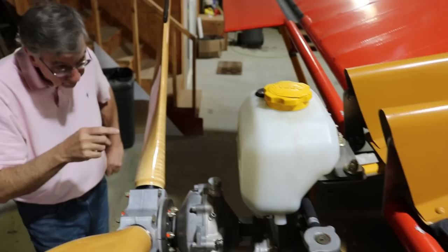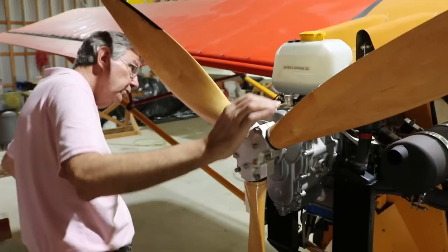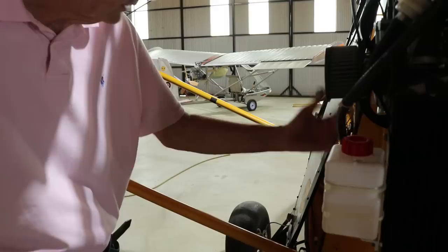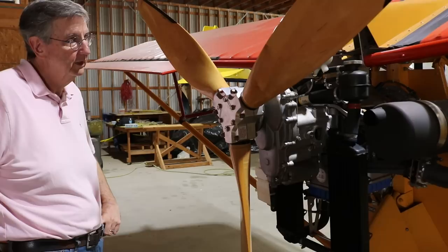This particular build was built for Alaska, so we put in a header tank for the fuel. The same wing tanks we discussed are in this airplane, with fuel coming into a header tank and then to the engine via an electric fuel pump — plus the engine fuel pump, giving dual fuel pumps. That's because there's turbulence in the mountains of Alaska, and it's always good to have a header tank in turbulent conditions.